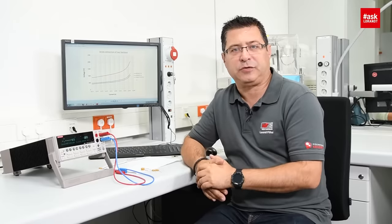In case you have a high voltage application like 600 volts and you have only 300 volt varistors, you can put these two 300 volts together and then you can withstand 600 volts. The current stays the same flowing through both — of course this is a series connection.